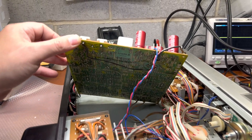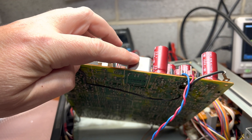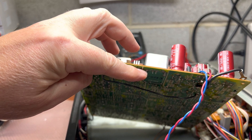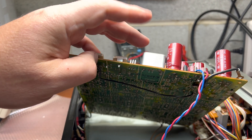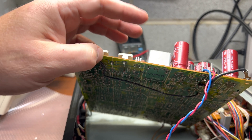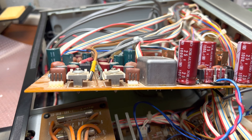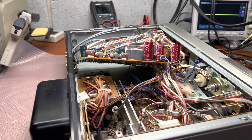I opened the board and I'm going to desolder the bias generator because something weird is happening on Type 2 — it works for about 10 seconds and then stops rising. Type 4 fortunately works, but when we adjust the level for oscillation it just doesn't work properly. I'll open it up and see if replacing any capacitors helps.